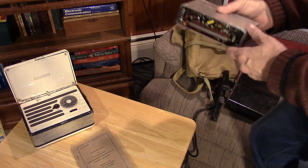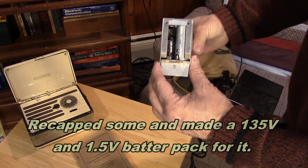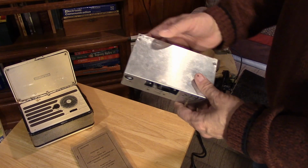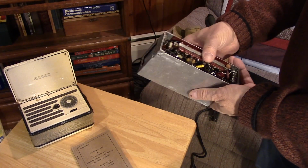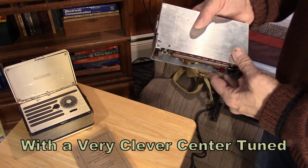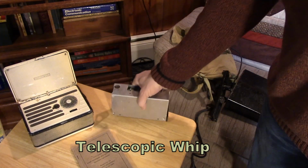Okay, so this is the transceiver. As you can see, it's ultra compact, and it uses those battery tubes inside. This is approximately a 200 milliwatt AM transmitter and a single conversion superheterodyne, all in this miniature package. So this is 1942 vintage, and I have it crystalled up for 3885 AM, believe it or not. But these two are very related.